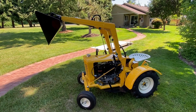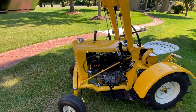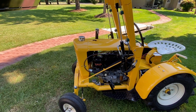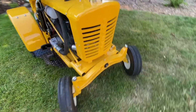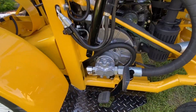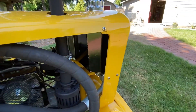This 1963 Panzer I got in about 2001 and I've played with it on and off. I changed the motor from a 6-horsepower Briggs to a 7-horsepower Kubota diesel, water-cooled. It's the original grille, original axle and wheels. There's the pump married to the motor, and the hydraulic tank is nested inside the original grille there.